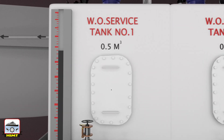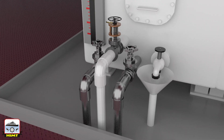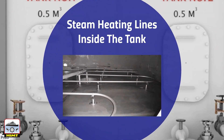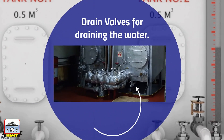The waste oil service tank is also fitted with a manhole door for cleaning and inspection. These tanks fall into the category of enclosed spaces, so proper risk assessments and permits should be prepared before entering. The discharge valves of these service tanks are quick-closing type so that in an emergency such as fire, they can be shut off from a remote location like the fire control room. Steam heating lines keep the waste oil warm for better combustion. A drain line is also fitted to drain the water present in the waste oil to the bilge holding tank before starting the waste oil dosing pump.